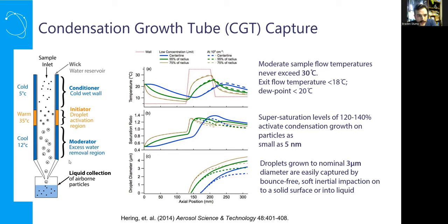The moderator stage is there because if we went just from cold to hot, we would have a giant soupy, highly condensed high water vapor flow entering our sample downstream, and we don't want too much condensation to create a mess. So after droplet nucleation has occurred, the moderator pulls a little bit of excess water vapor out of the flow. Its temperature is user-settable and does not appreciably affect droplet growth, but it lets you control liquid gain and loss in your liquid vial.